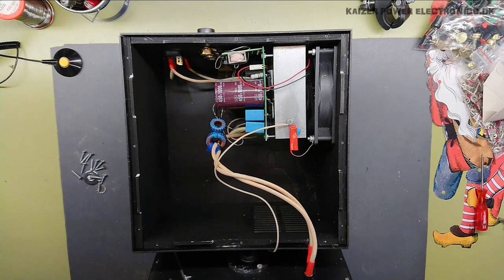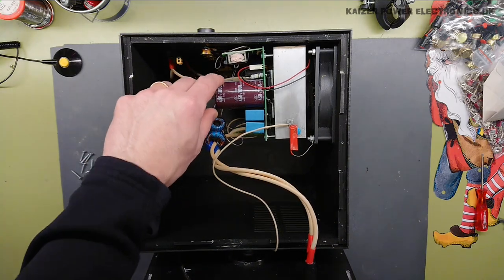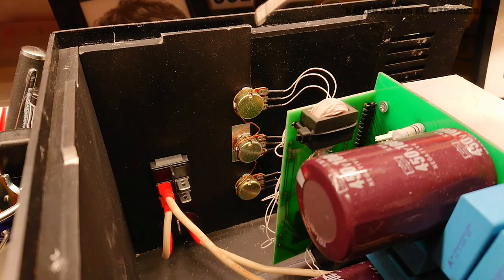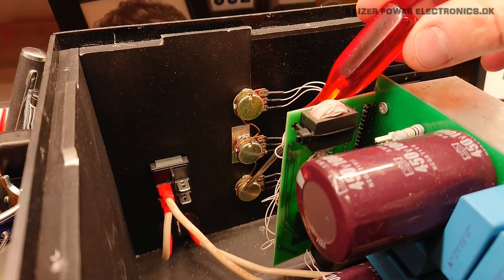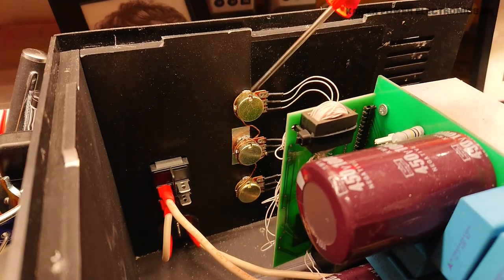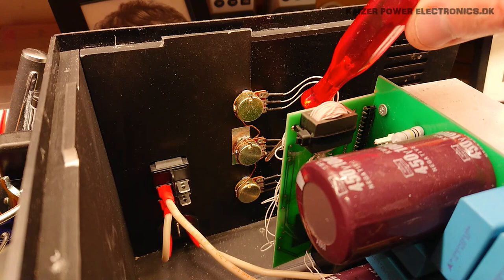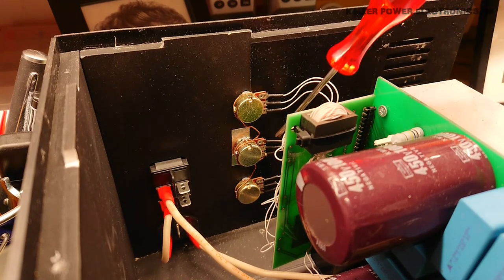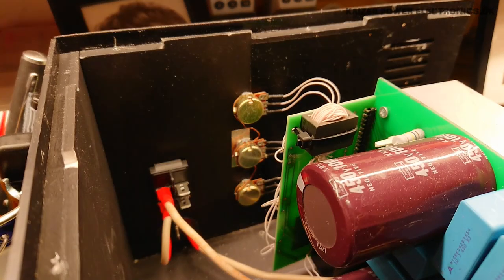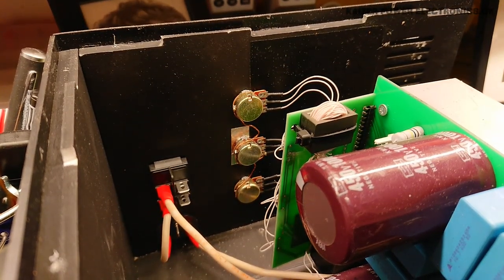But just from a first glance, this looks like a regular SSTC. If we start out with the driver and input section, we can see here that we have the 3 potentiometers, that they have in fact placed a ground wire going between all 3 of the chassis here, and that goes to ground of the middle here. So they actually had to ground the potentiometers when they are mounted so close to the inverter and primary coil.